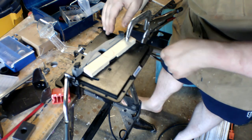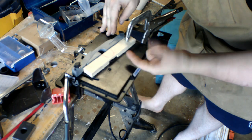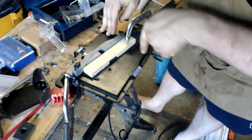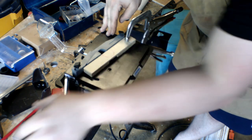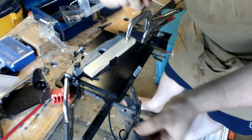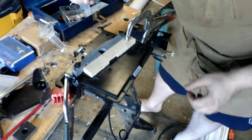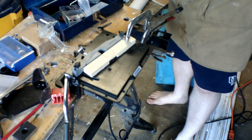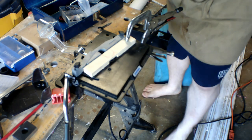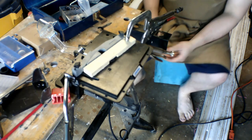So what I'm going to do here is I've got a cutoff wheel in here. I've got a block right here. This allows for 0.2 inches on this side and 0.2 inches of depth. And that should effectively cut this in one go. I may need to adjust the cutoff wheel, but I can measure that with the micrometer. So here we go. This doesn't mess up.